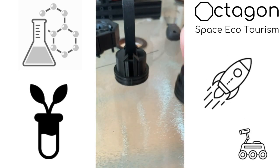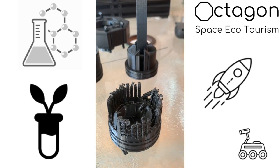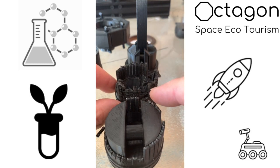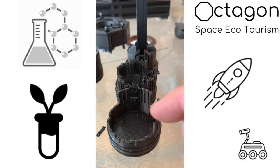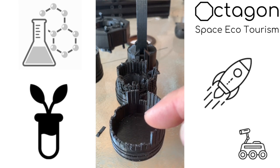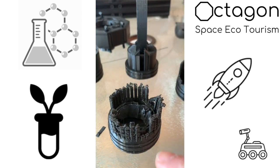So what do you do when this breaks? Well, you make it even bigger. And here I turned around and I said, oh my God, I broke my 3D printer. This is thicker than this guy, but it didn't print. So what's going on? When the printer gets to this point here, it only has all these little individual stalks to do, and the printer head is continuously retracting. The gears that retract and pinch the filament end up wearing the filament out, and there are little gear marks on the filament. The filament gets worn out, and then it doesn't retract anymore, and it doesn't push in either. So that's what we ended up having over here.